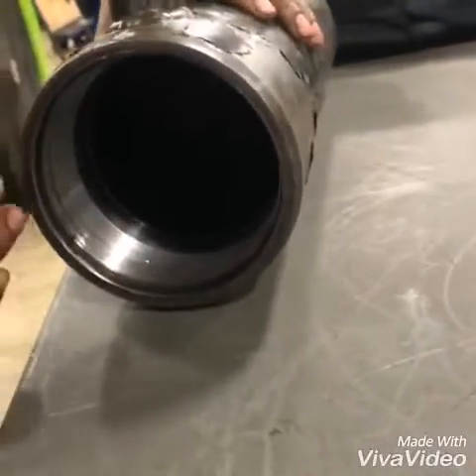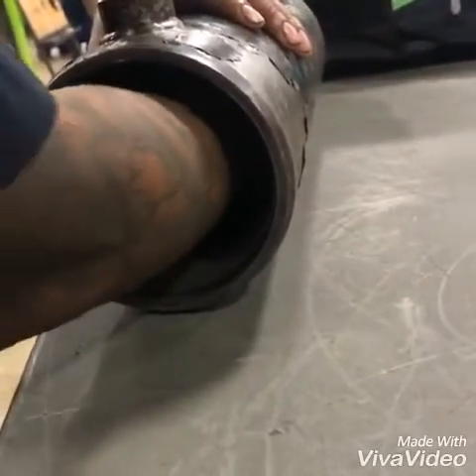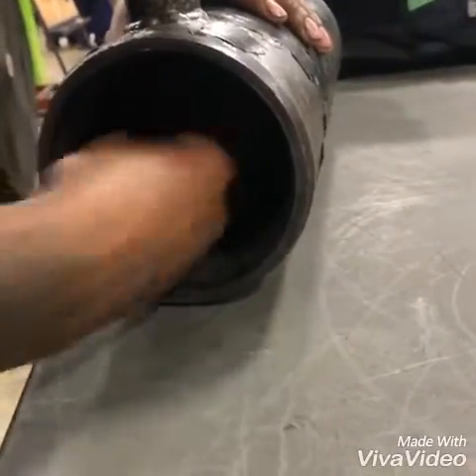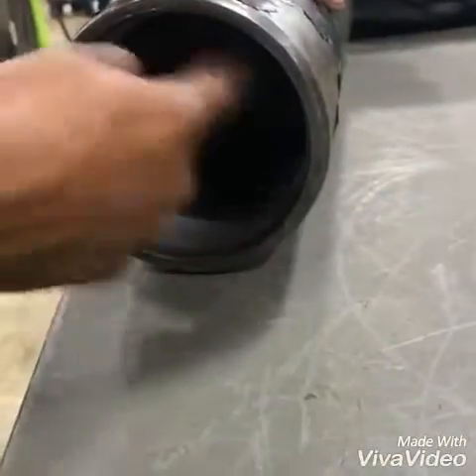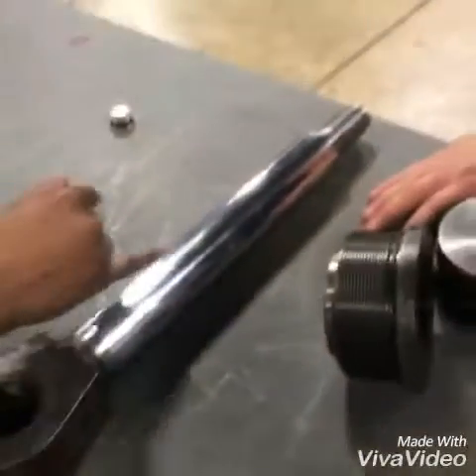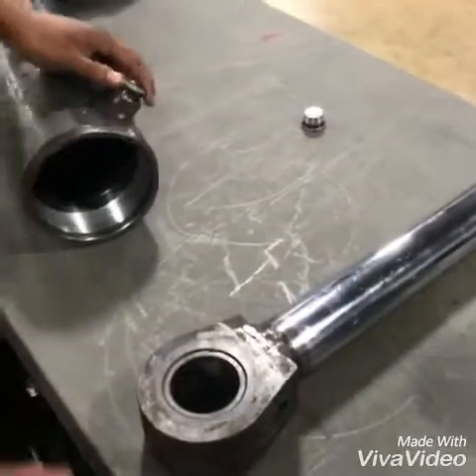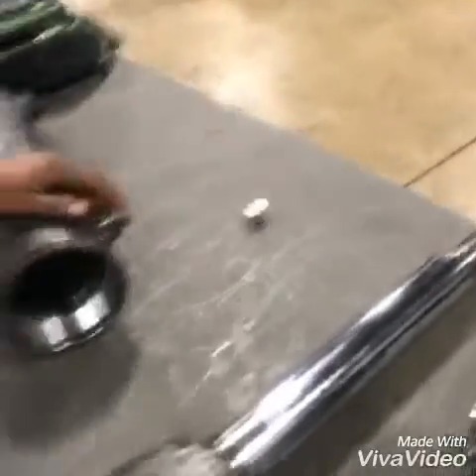It's a little dark right now on the inside, but you want to run your hands in to feel for any damage. Feel if it's out of round — you could use a dial indicator to check the inside of the cylinder, and you can also put a dial indicator on the outside of this rod or shaft to check for runout.